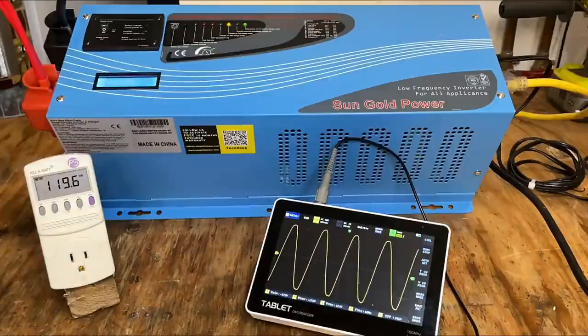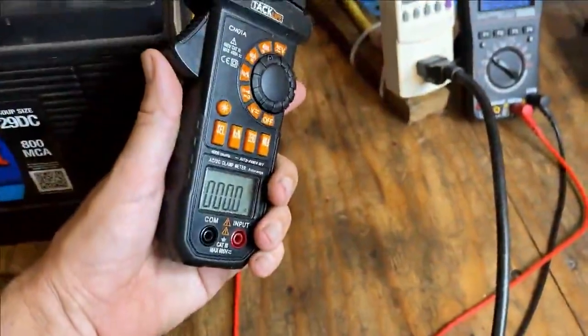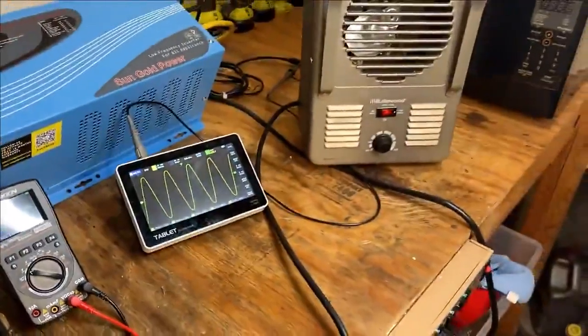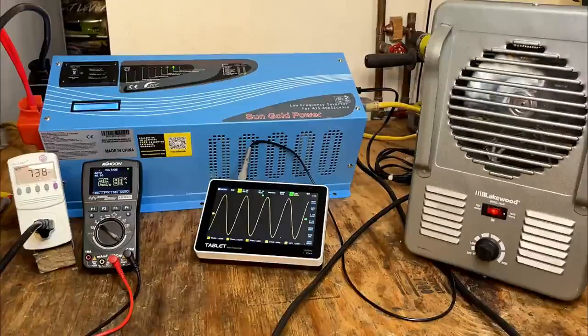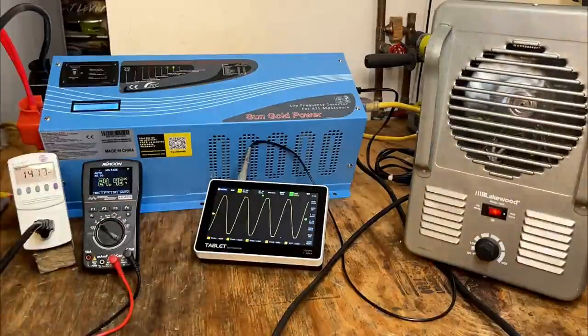Anyway, let's break out a space heater. We'll try a resistive load and see how this thing does. I've got the space heater hooked up, an amp clamp on the battery bank so we can see what we're pulling, and also a multimeter on the battery bank to see the voltage — currently at 27.23 volts. So we're pulling about a 750 watt load, the battery bank is at 26 volts and dropping, and the sine wave looks good. All right, 1400 watts, 24 volts on the battery bank, and the sine wave is a little bit distorted on the peaks, but overall not too bad. I'd say that's a pass.